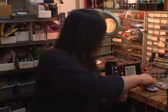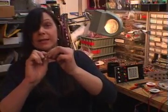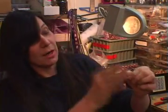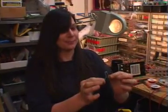They are simplicity itself. What they are basically is a photocell, just like a light meter — a light-dependent resistor. The more light that is shined on this thing, the more voltage passes through it. You can hook this up to your synthesizer, or you can mount one of these right inside your Speak & Spell, or whatever you're circuit bending. By shining a light on it and playing it with your hand — blocking or adjusting the light — you can adjust the circuit inside. It's kind of like a little theremin action, doing things with your hands.